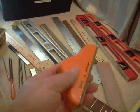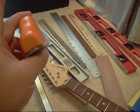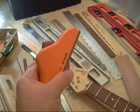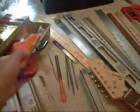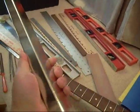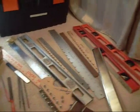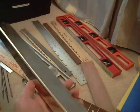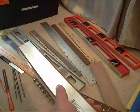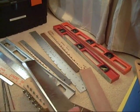Most of these files are not perfectly flat, so I've marked the bases at an angle so I know which ones are not true. I color-coded mine — red ones are single cut and orange ones are the rougher double cut, though I don't use them that often. This is the main StewMac 2-foot leveling bar. With shipping it's about 80 dollars, so I was putting off getting it, but I work on mostly cheaper stuff so I was confident enough with my other homemade tools.